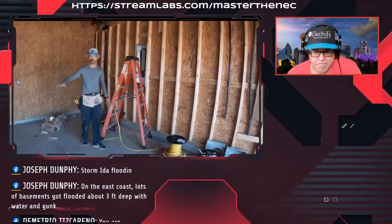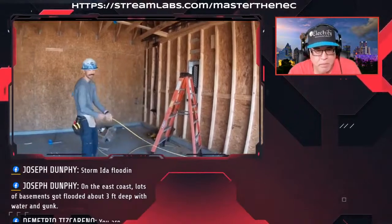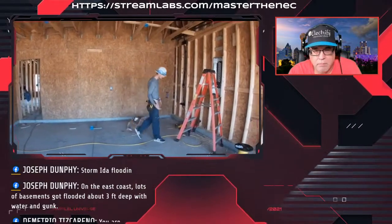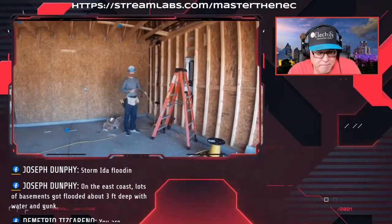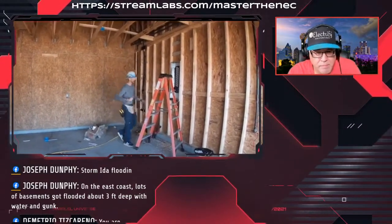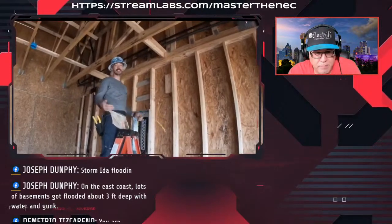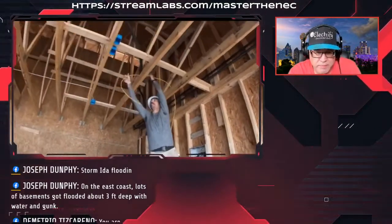First, I like to clear out the garage. I like to use this space just to lay out the wire so I can run it a lot smoother. Pulling your wire out like this is the key to keeping it looking good. I'll agree with that, 100%. In essence, it doesn't really matter, but I've been doing this for a long time, and I like my wires to look as straight as possible in the attic. I'm not going to start in a hole because, especially with these runs being so long, they're probably going to get kinked up and you have to keep coming back. So we're just going to start in this bay. Makes sense. That's what I would do.